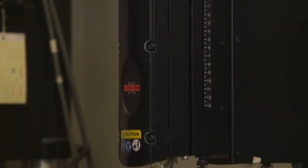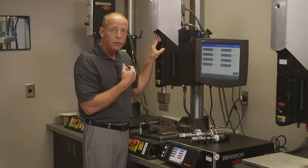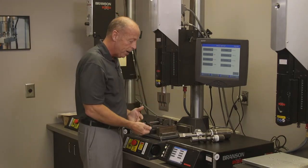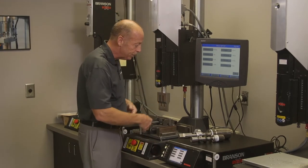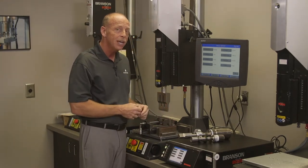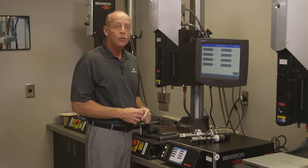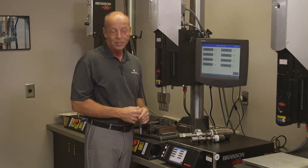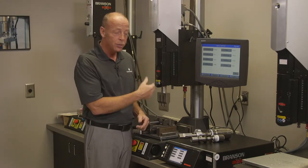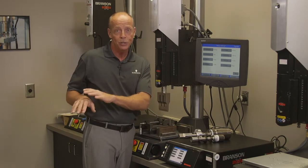The stand welder is generally a pneumatic press. In more sophisticated applications, Branson offers a servo-driven press for very precise control. And the operator uses dual anti-tie-down palm buttons and fixturing that may be very crude initially in some applications to pretty sophisticated pre-production fixturing. Ultrasonics offers very tightly controlled parameters. This is where we determine the optimum weld mode, the force we're going to use, the sealing configuration, and this will all be brought in, generally speaking, into production parameters.